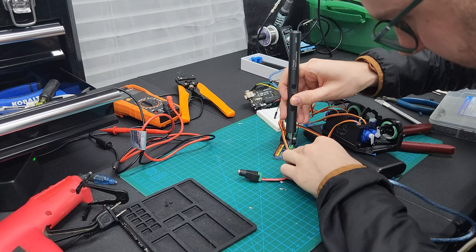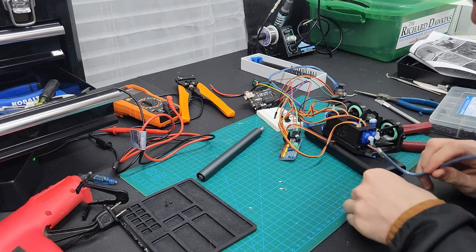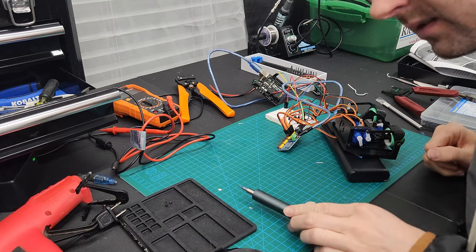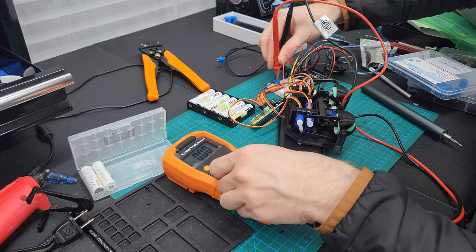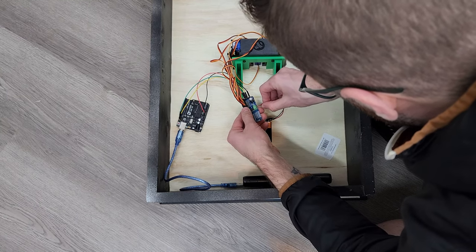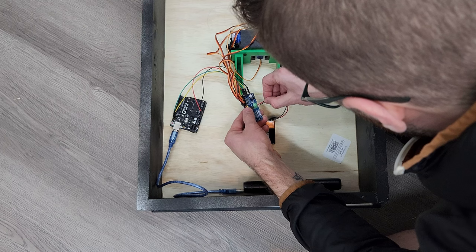Powering things is not my forte, so I couldn't figure out how to get a USB battery pack to power both the Arduino Uno and the servo driver board simultaneously. I tried splicing a USB cable to power both at once — don't do it, don't recommend it, didn't work. Every time I plugged them both in, it would just turn off the battery bank. I think there's some kind of short circuit detection safety feature. So I ended up just sticking a 9-volt battery in the back just to get this done so we could see the cool effect.